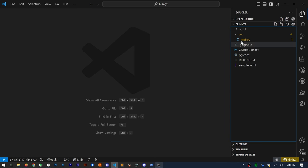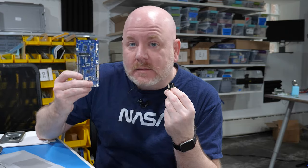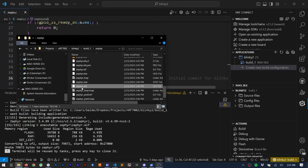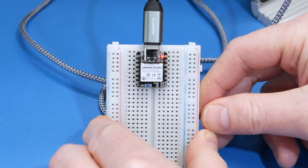I think most people would use the Arduino library to program these boards. However, the NRF7002's driver is currently only available in Zephyr. So my first step was to create a project with the NRF Connect SDK and make sure I understand how the board works. Unlike the design kit, the Xiao does not have an onboard debugger and programmer, which means I need to double-tap the reset button to put the board into a bootloader, and from there copy a UF2 file to the virtual drive. With that, we have an LED that blinks.